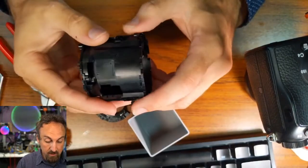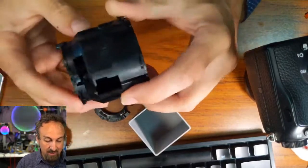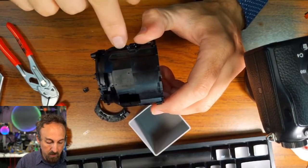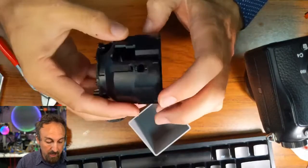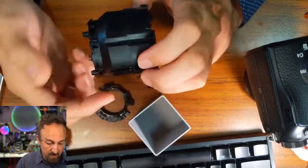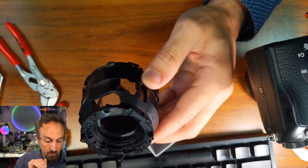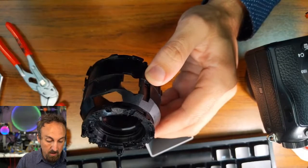So when we look at this, the number of these features. You've got at least three axes here because these are pinholes. They're on axis, normal to the tangent face of the ring. So those had to have been individual actions. So you've got at least three there: one, two, three. This feature here is also normal, so it had to have been a fourth action.